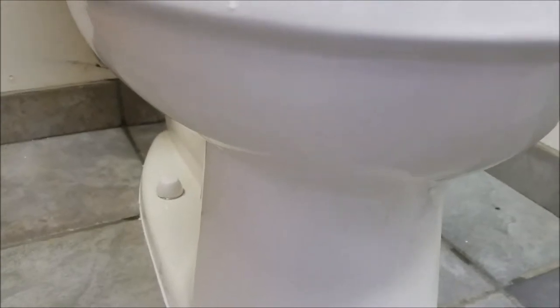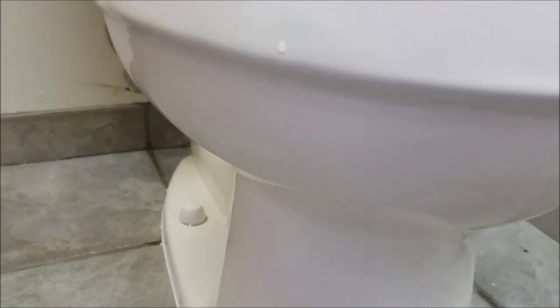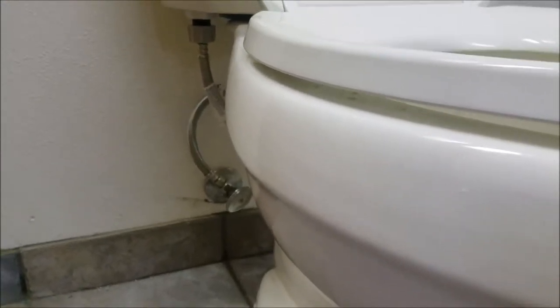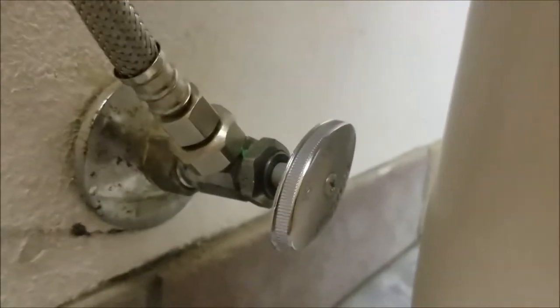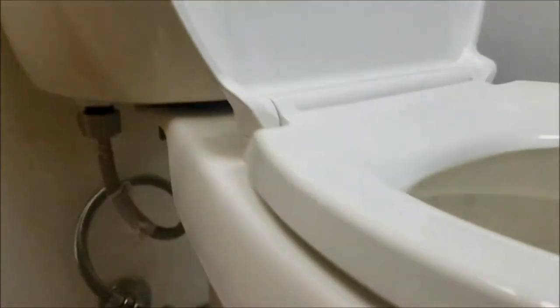So we're still in the front bath — the bathroom by the laundry room — fiberglass shower, toilet, one sink. It's set. We already did the first portion of this video showing you the flange and the bolts. We left those in place — we didn't want to get further into the project because they've already got a big project in the master bath to get the flange repaired. This one's set good — a couple of shims on the left and then capped it back in. We did put it on the shutoff valve; it was leaking, so we tightened that up. Please monitor that for any weeping or dripping — it's not our product, so if it does begin to leak we don't warrant that. As a point of courtesy, we tightened the packing nut. It looks dry right now. And then we put a little adapter — half-inch NPT with a gasket — that adapts down to the three-eighths supply line up to seven-eighths, and then it's a 20-inch braided stainless steel by Fluidmaster.